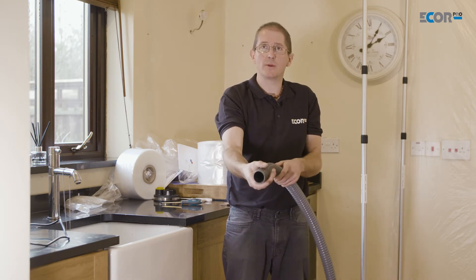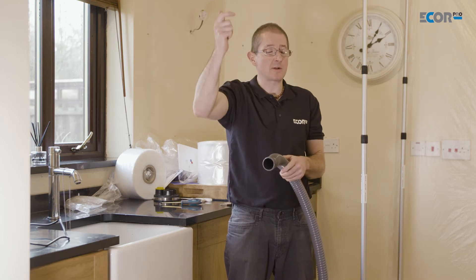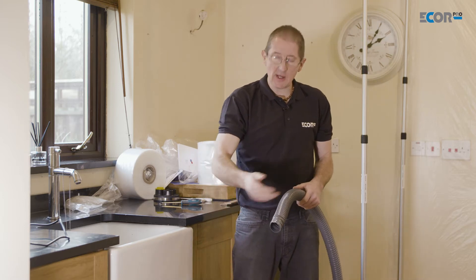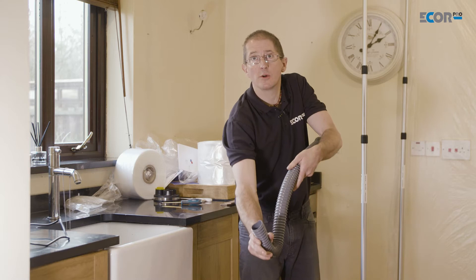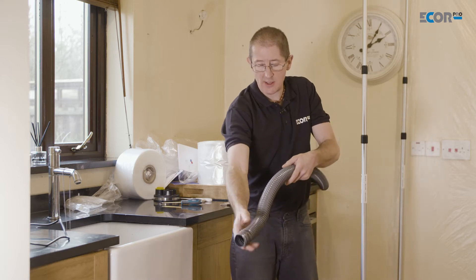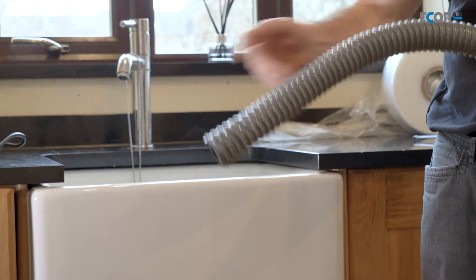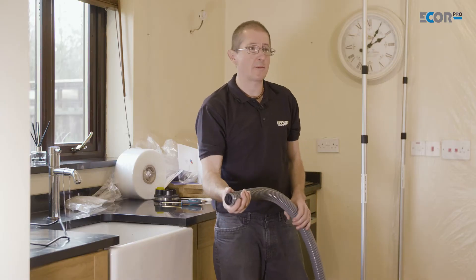Seal around the pipe with some cloth so that the humidity then goes into the stench pipe that normally breathes. What if we can't do that? Well, we could take the water out of the toilet bowl and poke the pipe through the toilet bowl, through the bend and into the stench pipe, and then put some cling film over the top of the toilet. That way the humidity still goes through the stench pipe and the cling film prevents smells from coming back into the room.